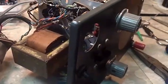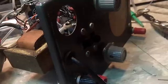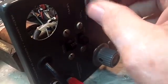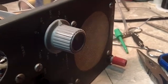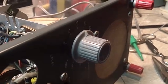I'm not really sure — maybe I did something in the process of taking that off. This ground is why it keeps going loud and soft when I touch it. I don't hear the crackling now. You hear the buzz — I think that was always present. If you ground it out you don't hear that buzz either, so this might be all that was wrong: just a bad cap.